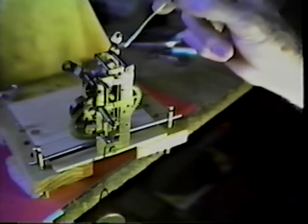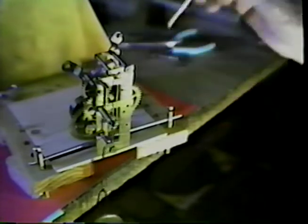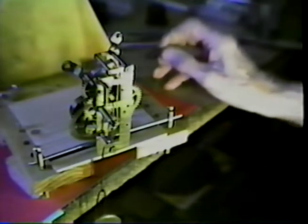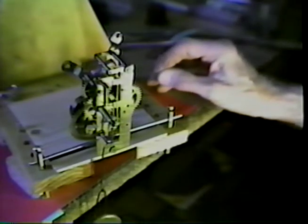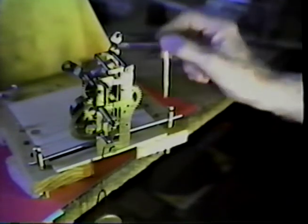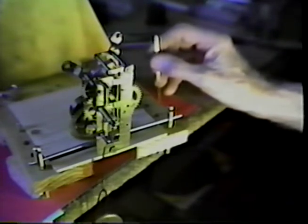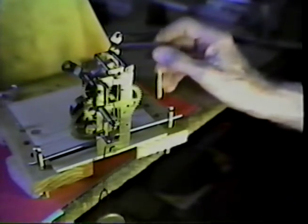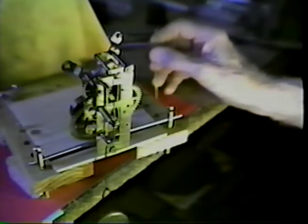When I had this off here a few minutes ago, when I was preparing to place this on the test stand, I removed the verge, and with a little rotary soft steel wire brush, I wire brushed all of this, which gave it a satin finish that obscures the scratch marks and layout marks from making the piece, so that the appearance is very, very nice.